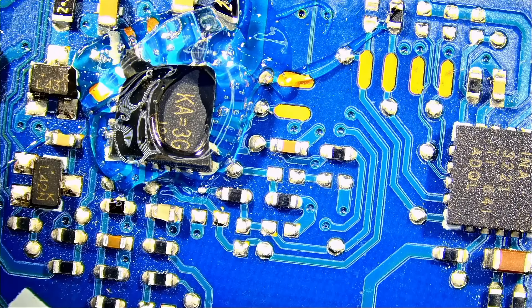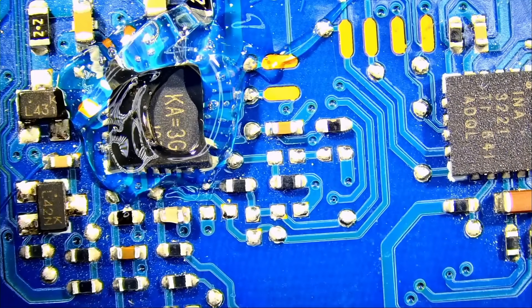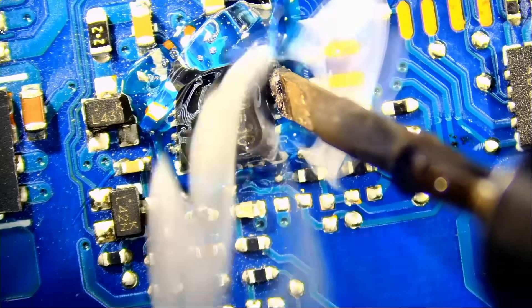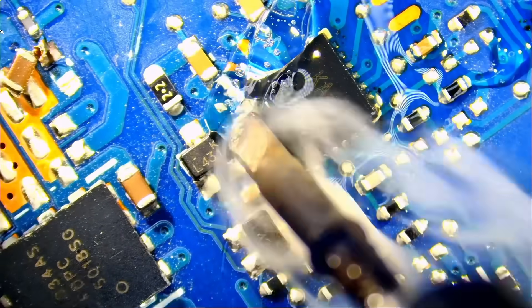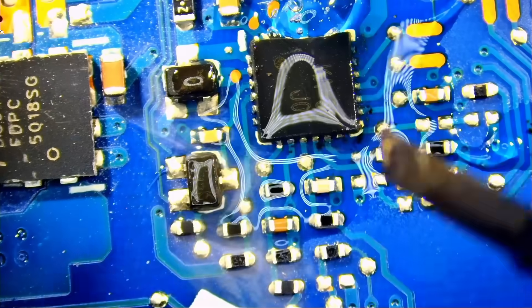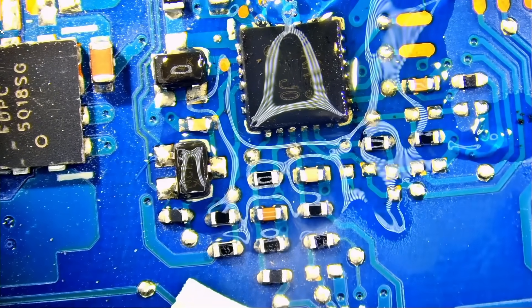Let me tell you the temperature — it's still heating up. I currently have it at 440 degrees Celsius. A lot of heat. Maybe I can just put a tiny bit of solder on the tip. Notice how flux is still fresh. Flux is not burning as easy — it fights heat. It's still effective, it's still bubbling. So if I'm soldering a chip, just a tiny bit of flux goes a long way. I do not need to keep reapplying.